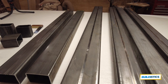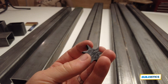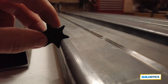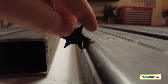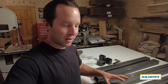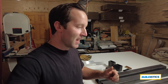Moving forward, next steps are to print some parts. I actually already printed this — it's the steel tubing radius tool. Make sure you print this out; it's like a gauge to check the radius of your tubing. I'll go with number six, which gives you different profile options. Once you know the profile of your steel tubing, you can start printing parts based on that, as well as drill and tap everything. We'll see you in the next one.